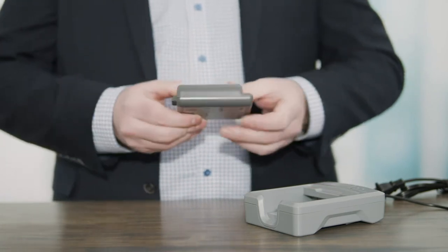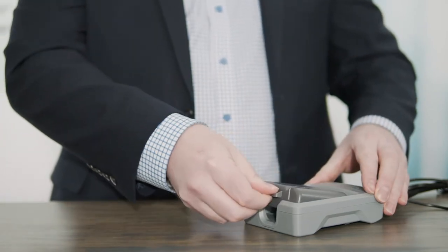In this video, I will explain how to take proper care of a PX5 battery should any long-term storage be required. The PX5 battery uses lithium-ion cells that are known to self-discharge at a rate of up to 2-4% of current charge per month. Regulation on shipping lithium-ion batteries require that they be between 20-30% charge during transit. So therefore, any new battery will need to be charged before storing or first use.